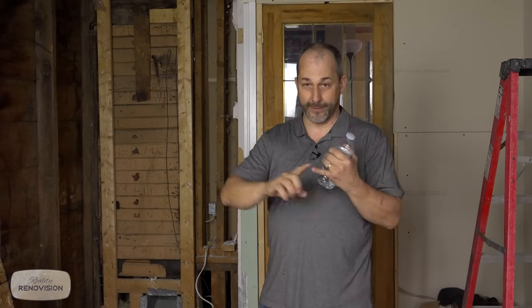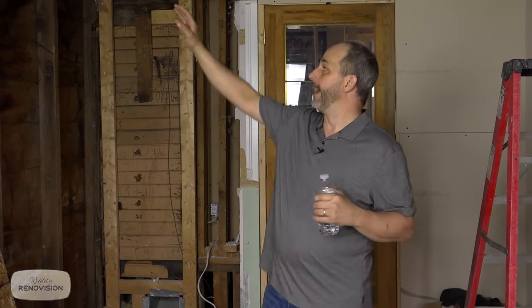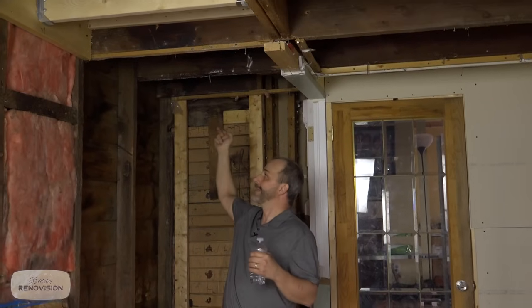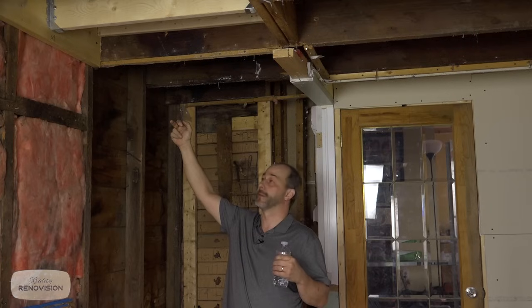First of all, we have challenges because all of our exterior walls are not straight. They're all bowed under the weight of the building, and all of the floor joists are not sitting on anything. They're all just nailed into the side. Okay, so there's lots of sag, there's lots of movement, there's lots of pressure. So I don't have anything plumb in the entire building.